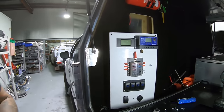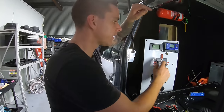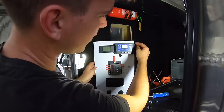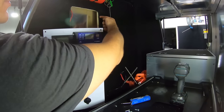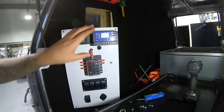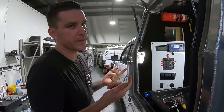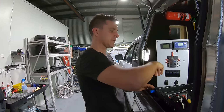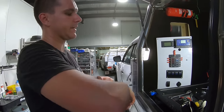So now that the new controller is up, because it's so large compared to the old one, all I can do is put two screws in it. If I try to put more, I've only got a certain size window inside here and the screws would foul on it. That's fine — it's not going anywhere. The next step is going to be wiring the solar output to the battery, then jumping onto the roof to do the solar panel and running the wires back in.